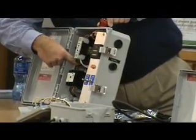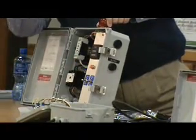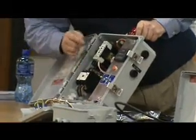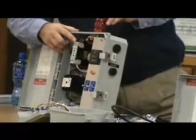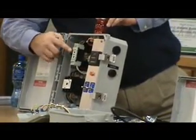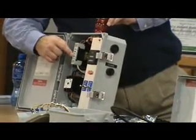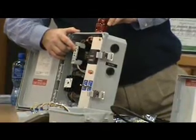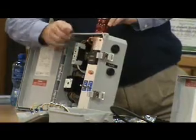So the 120 volts gets applied to this coil. That's a magnet inside there. It pulls the contacts down so it turns on your pump. This panel happens to be what we call our economy time dose. It has a different looking little timer that we've started using here. This is made by Siemens, and it has your off time and on time settable right here. And the reason we started using it is it's so versatile. It'll go from, I think, a 0.1 second range all the way up to like a 10-hour range you can set on one of the dials.